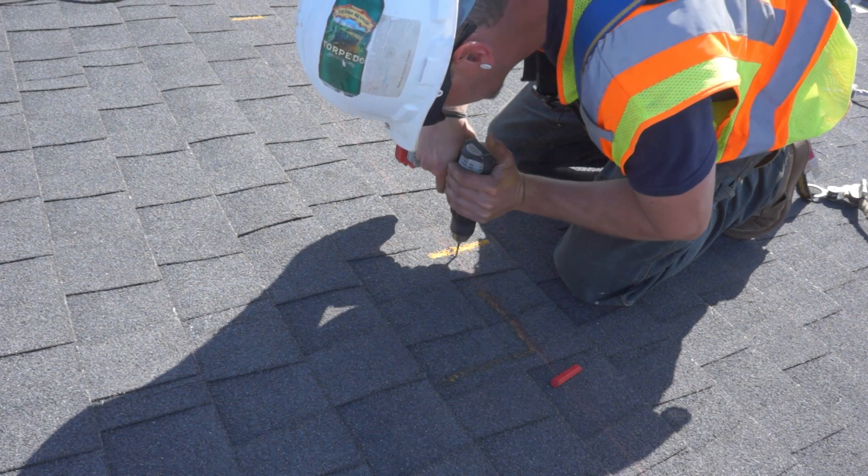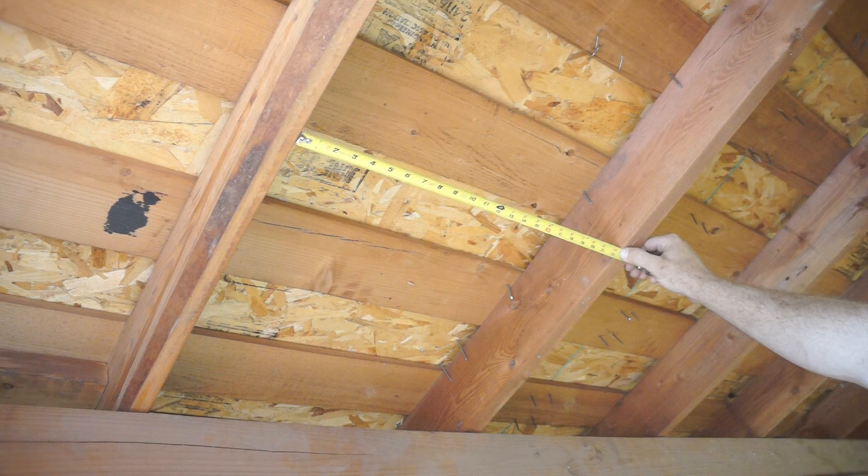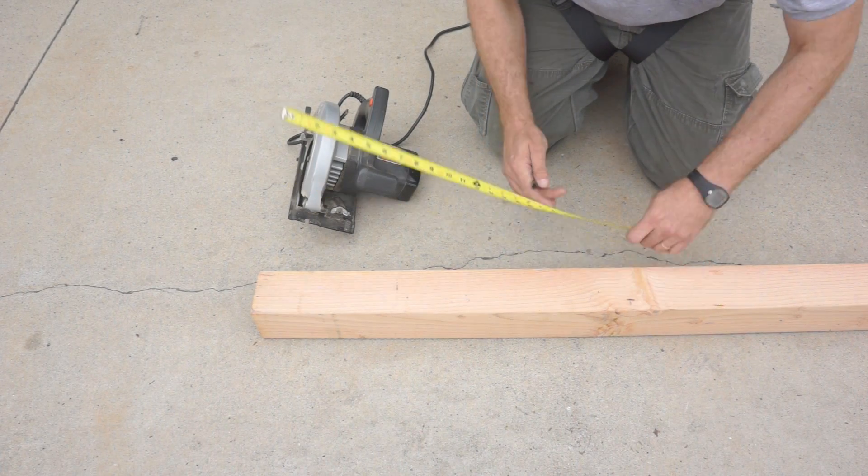If you are able to drill the holes prior to installing wood blocking, it would be helpful to either leave the drill bit in the hole so when you're in the attic you can quickly find where that hole is located, or on most days you can just get in the attic and look for the daylight — that's where your hole will be where you'll position the wood block. The next step is to measure the distance between the rafters directly under the roof attachment and cut a wood block to fit that dimension.